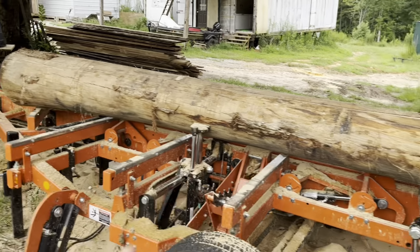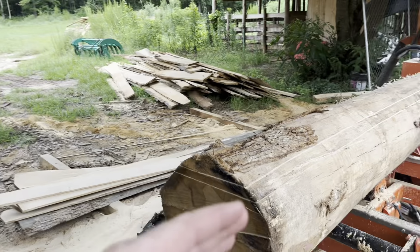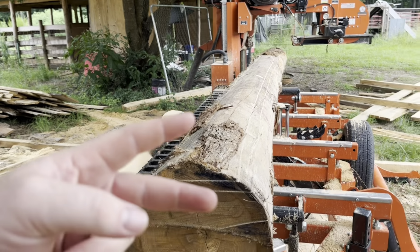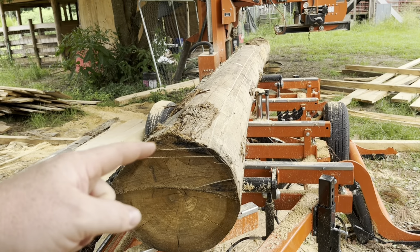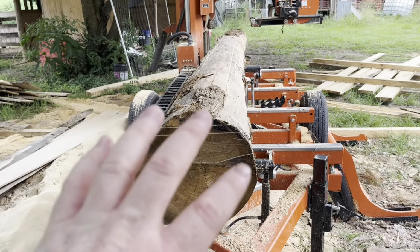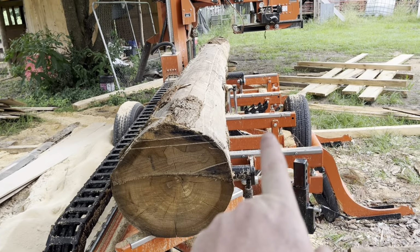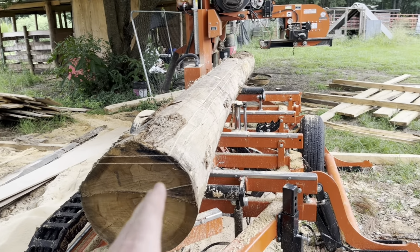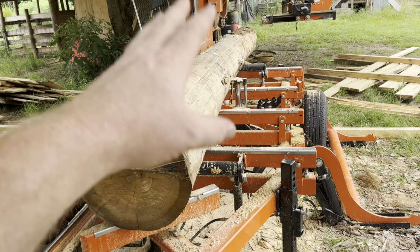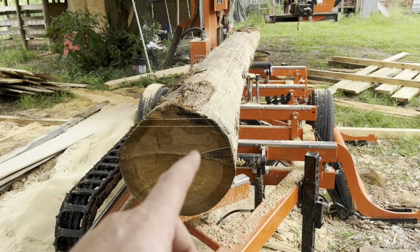The other thing I do is, all I'm looking for is to get a flat side. So I make 2 cuts. I make the top one, I drop an inch, I make another one. Then you rotate it, and take 2 more cuts off. Make sure your toe board is right. And then when you flip it the 3rd time, let that toe board down. Everything has to be leveled out. Then I'll slice it down.